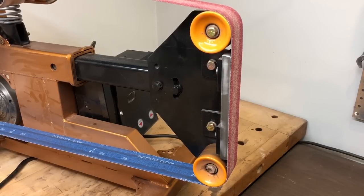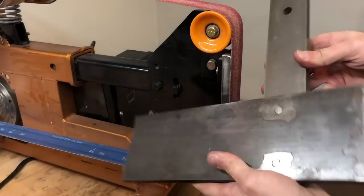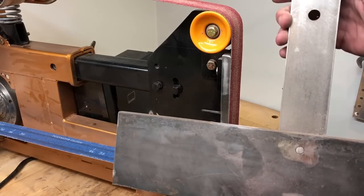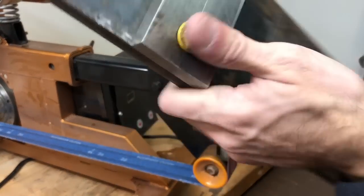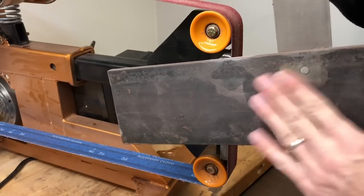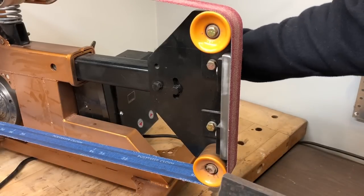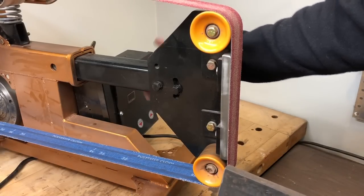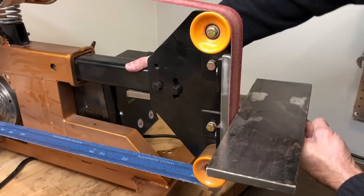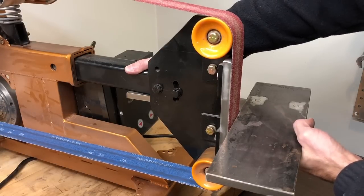There's also a work rest, and that's all included in the less than a hundred dollars total. It's a piece of half-by-four and half-by-two-inch flat stock with bolts drilled and tapped in — they're ground flush. It bolts up underneath here; I've drilled and tapped two half-inch bolts into the bottom of the tube, so it sits right up under there and I can adjust it to ninety degrees to the flat platen.